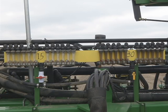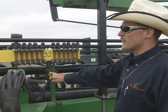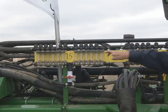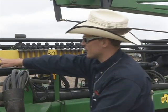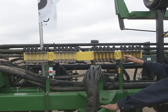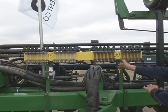As you're planting, the wheel is engaged with the wing wheel, causing the pump to draw the product from the tank and send it, pressurized, into these plenums. This one here is marked 30 for the 30-inch rows. So if you're planting corn, you will have the 30 open and the 15 closed. We're planting corn right now — the 30 is all filled with product and the 15 is all empty. If you're running 15-inch rows for soybeans, you'll obviously open this valve. If you're running soybeans on 30-inch rows, then you'll just stay the same with 30 open and 15 closed.